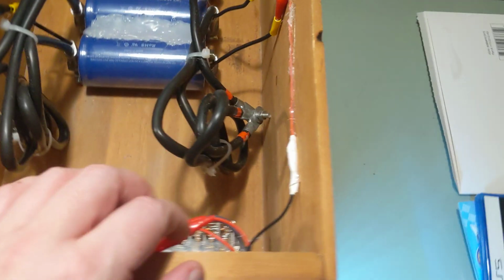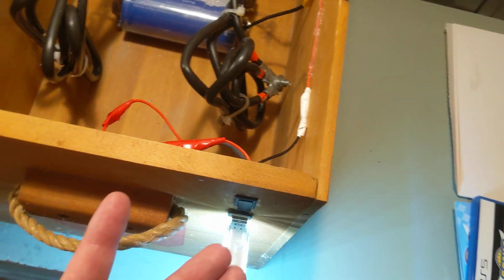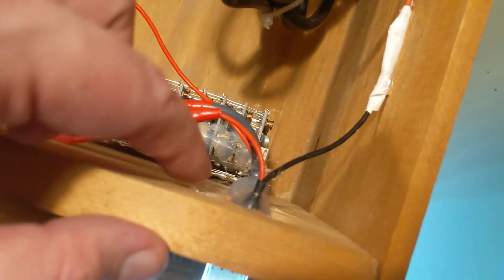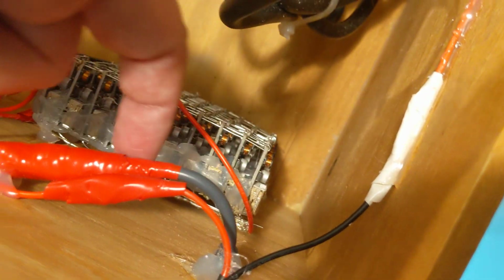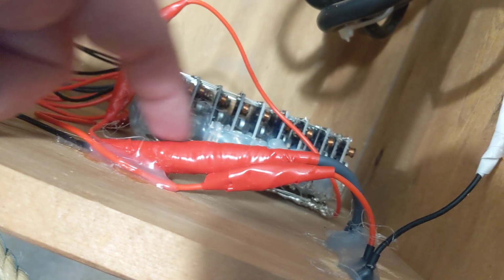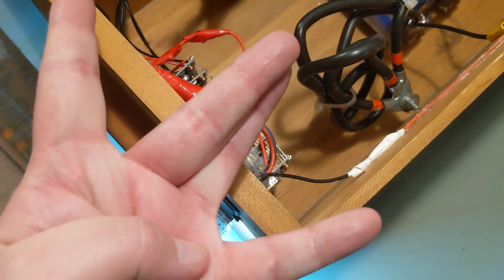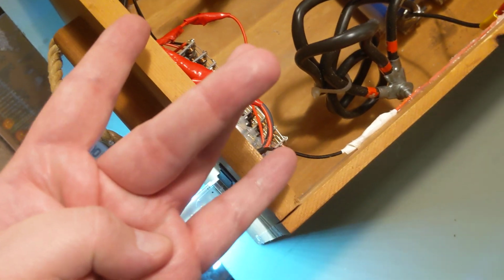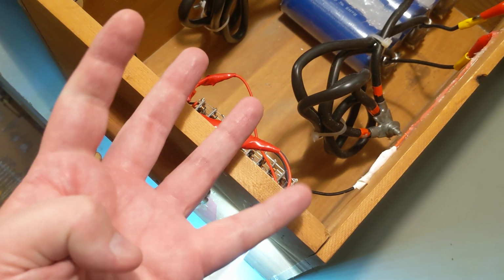So for most phones, the best way to get around it so that it works with the majority of devices is, what I did was you take the output pins of this big gray cable here, inside of this clustered ball of electrical tape. I took the 4 cables coming out of the back for the USB, and then you just want to connect those data positive and data negative connections together, twist them together, solder them together, and then only use the positive and negative here.